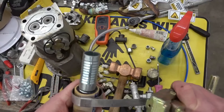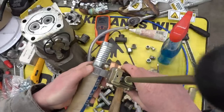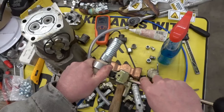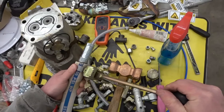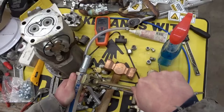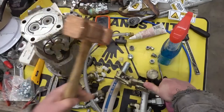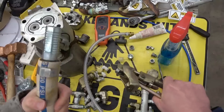You get these fast lock hose clamps, stainless steel, come in different sizes. And then you get the tool — I'll give you the tool for free if you buy enough of these. That's the Gillette razor: you buy the holder, you just keep buying the razors; we'll give you the holder for free. And this is a little fucky — there's a way to do this. If you're doing this every day, you know how. That's what we call in the trade, a clue. This cinch is down on here — you cinch down and give it a little whack-a-doodle. That dimples it, locks it in. And then you can break it off.